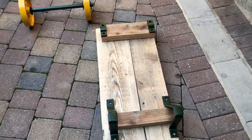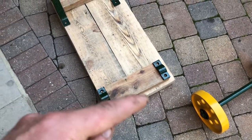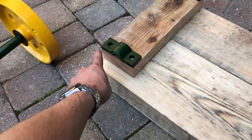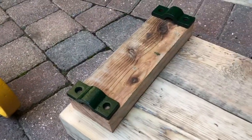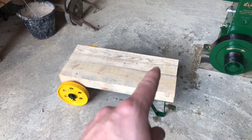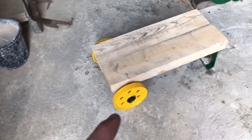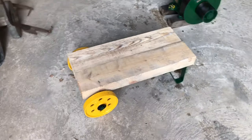I'm just going to trim a bit of this side, a little bit on the edge here. I'm not sure about what I'm going to do with the front - how close it is or not, we'll work that out. Generally that's the idea. I need to make some packing pieces for the hinges, so I'm going to have to put another piece of metal under just to raise that up so you can get the axle in. What metal are we going to use? Well, the rest of the old sack barrow - just cut a piece off there. I'm going to get two wooden pickaxe handles and bolt them in. This is not bolted together, this is just cut - it's held together by magic. At least we've got a vague idea of where we're going.